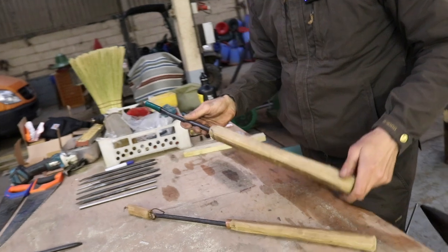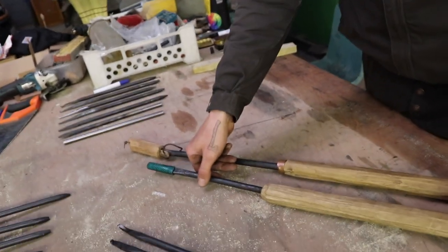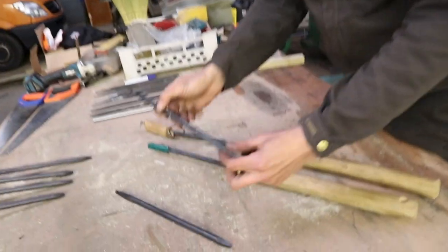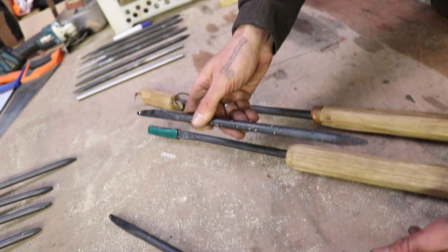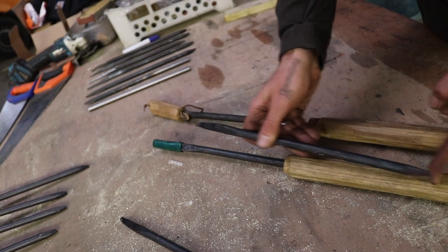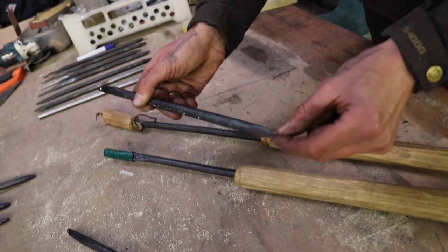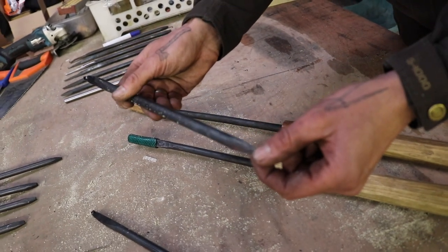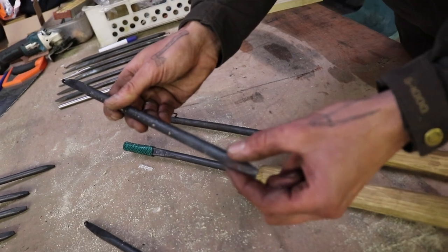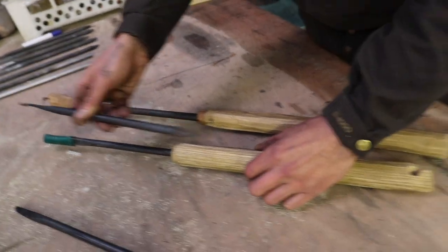And in terms of the taper that you did on the actual metal part itself, this is why you did a taper, isn't it? Exactly. So it can go in and hold in place. The taper is more for it to get in. It's not really holding it. Some people think that you can hammer it in further so that it's actually sticking a bit in the wood if you make this really pointy, but that is not necessary, in my opinion. I saw toolmakers, they just take down the edges a little bit just to make it easier to go into the hole.